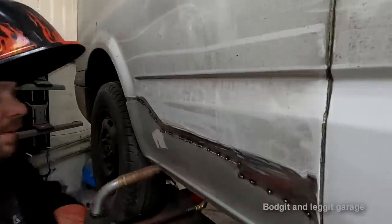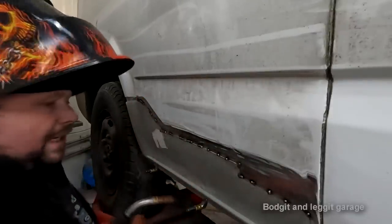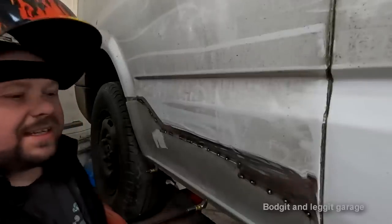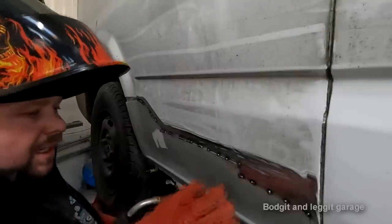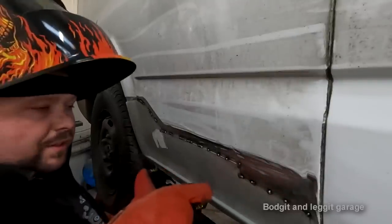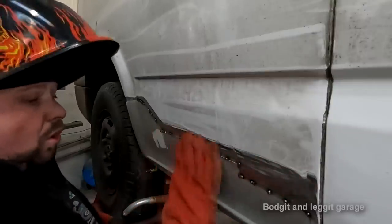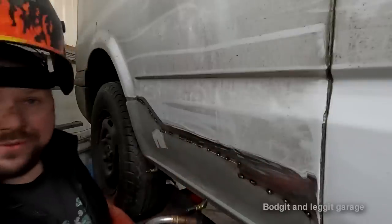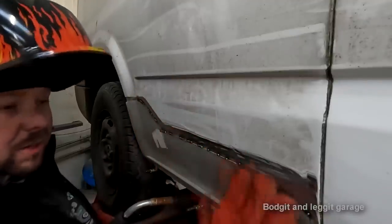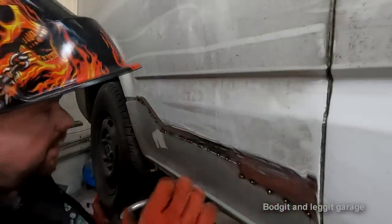And another thing I see with welding is the MIG welder is not set up properly. And look, unless you're MIG welding every single day, on all different thicknesses of metal, it is quite difficult to set up a MIG welder. The easiest thing to do is get offcuts of metal and practice on the two offcuts to see if you're burning through, to see if the penetration's right and all that. Or just do what I did and get a Fronius Transteel 2200 because it's got synergy mode and it automatically does everything for you. So I'll show you that also in a second.